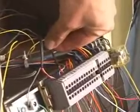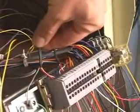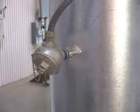Each of these components is pre-wired to electrical terminals located on the rear of the remote control assembly. The installing electrician is responsible for connecting these terminals, by number, to the terminals inside the Humidaire unit's upper control cabinet. In addition to the 3-phase power mentioned earlier and the hookup to the remote control, there are a few additional connections that the electrician is responsible for.